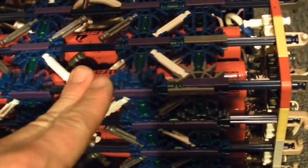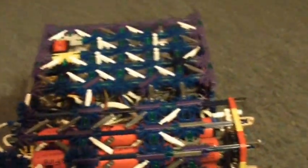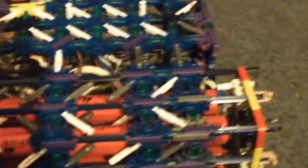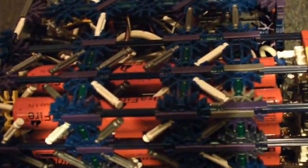The 21 batteries give me roughly 85 volts from end to end, and this thing pulls about 8 amps. That's a little bit much for the chip, but I'm going to get a current limiter and hopefully bring it down to 7 amps, which makes the total power consumption about 560 watts, give or take, on a full charge.